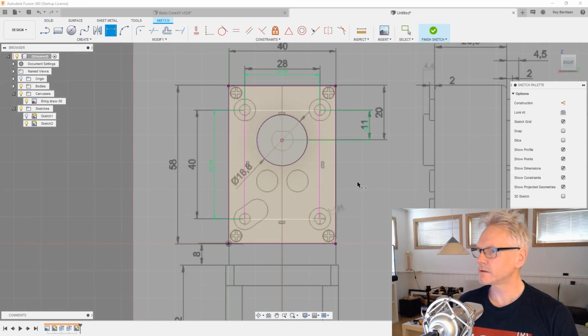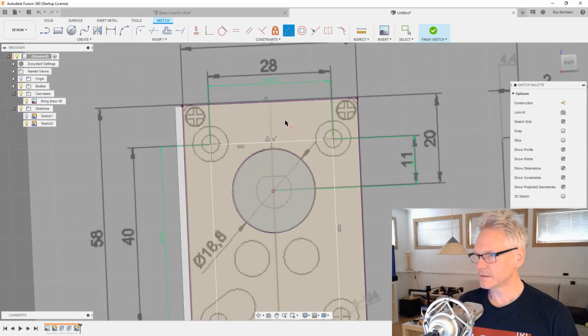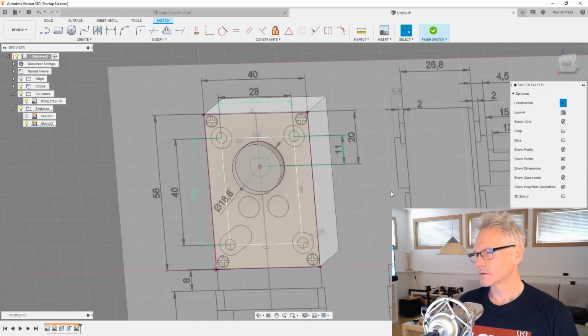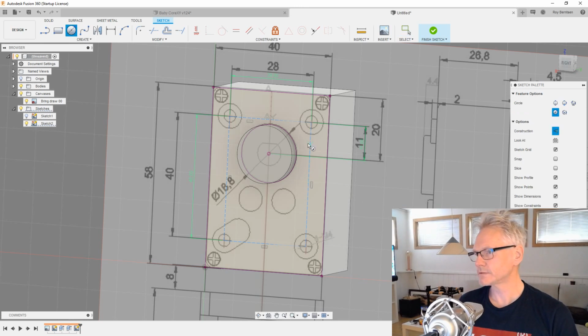And we are still not constrained because some of my lines are purple. So then again, I want to just use a line to constrain that. I'm gonna hover over here, find the middle, and just end that command and do another midpoint constraint between this guy and this guy. Then I can just make this one construction line. So we can also make actually this rectangle a construction line as well, and we can do C for circle